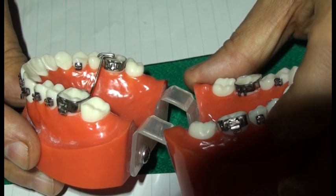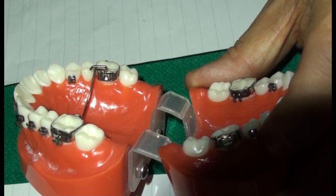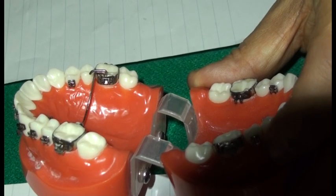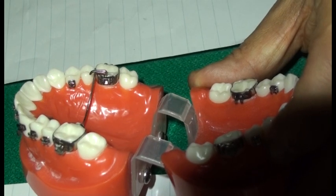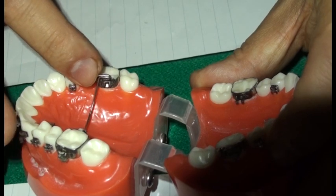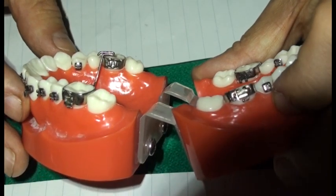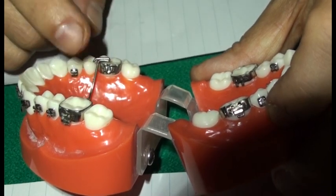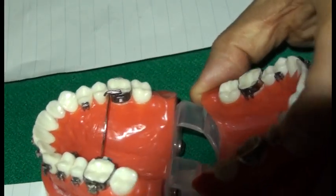You see it? What I've been doing until now was adjusting the left side, so that the right side was not showing any kind of activation. So I have also corrected the first order. In fact, you see there is very little, maybe a little bit, but very little activation in this direction. But there is the third order, which is still here. So I will need to correct on the right side the third order, and maybe a little bit the first order. So I'll take it out from here.